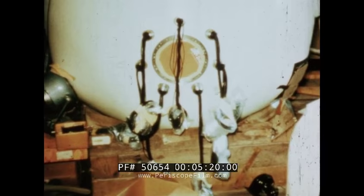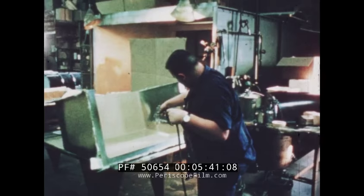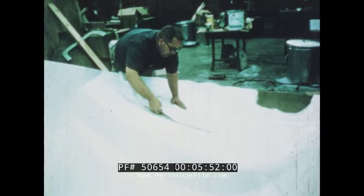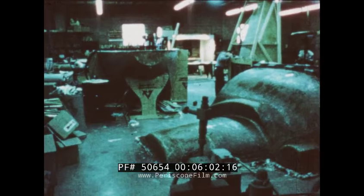Around the spherical pressure hull, a fiberglass superstructure, or fairing, is constructed to contain the mechanical equipment and to give streamlining. A conning tower is provided to prevent water splashing into the hull from wave action while surfaced. The superstructure parts are formed from fiberglass and plastic. They are laid up over these molds. There must be a high ratio of strong glass fibers in the polyester plastic. The sections are bolted together over a metal framework to withstand the impact of objects and to allow the submarine to rest on the ocean floor.